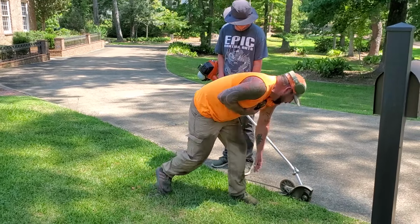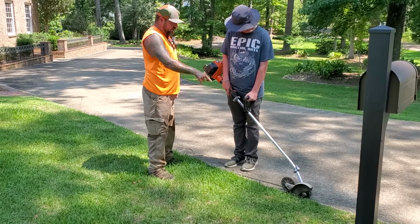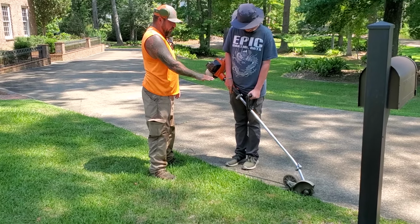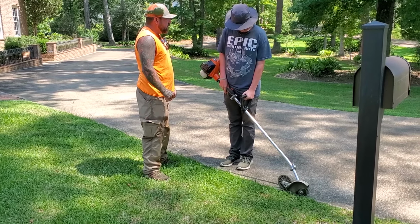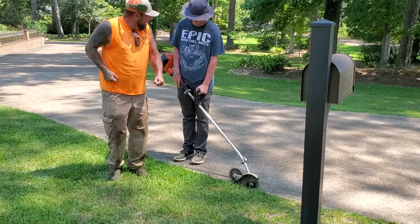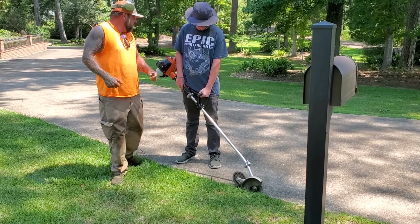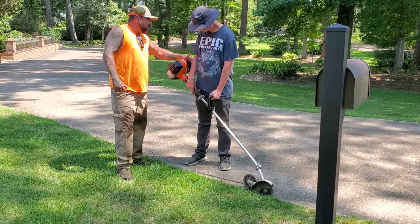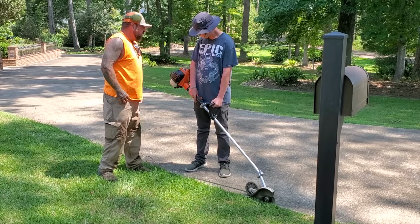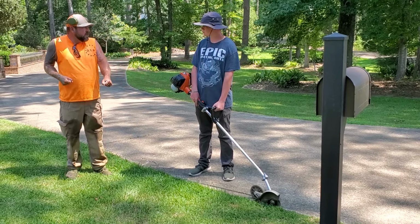All right, blade is in the crack. Now you pick this up, don't move. Pick up till you feel the skid plate touch. All right, so the wheel, now you're on the skid plate. Come down a little bit. Now your wheel's touching. So it'll roll. That's the angle you want to hold that. And you want to keep them arms pretty much locked up. All right? The back of your arm back here, like Haley told you, can be sitting on this for support, to help you be rigid, locked up.